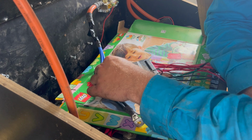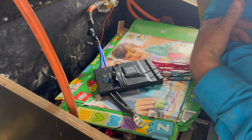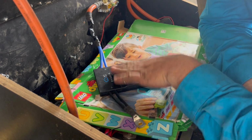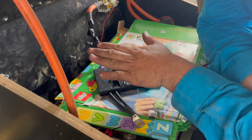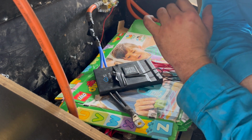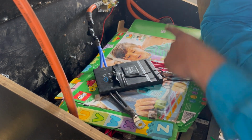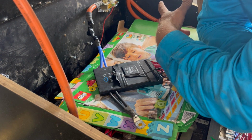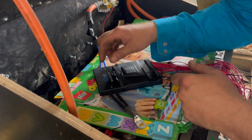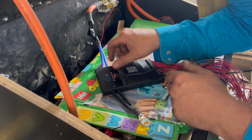Should turn on. It beeped. That's on now. That's bloody beautiful. That's really good. The old way of doing these, you had to short 4 to 5 volts more than the battery pack from the P minus to this one over here that goes to the main battery pack. So you had to make it so that if it was a 50 volt battery, 54 volts would turn your BMS on. Now they give you this button, not even got a light on it. So how good's that? We'll put it back up here.